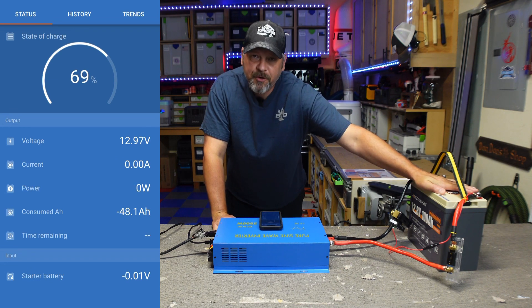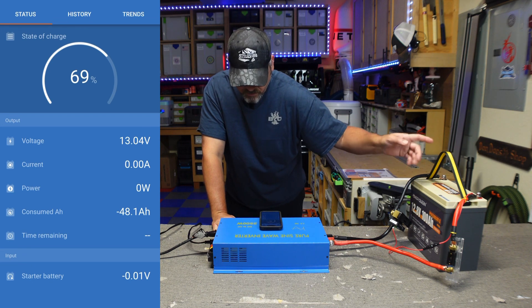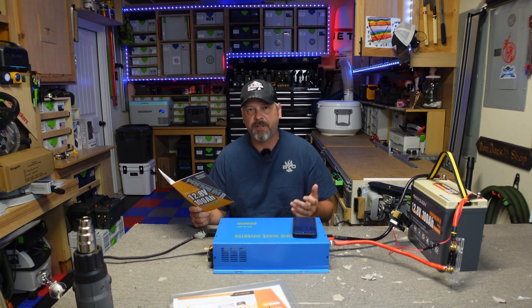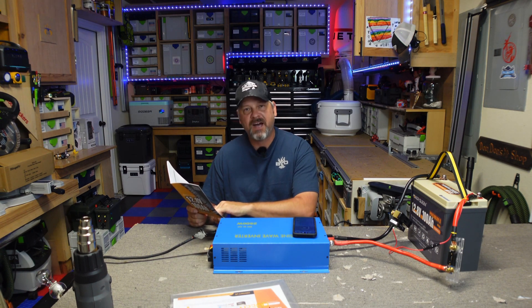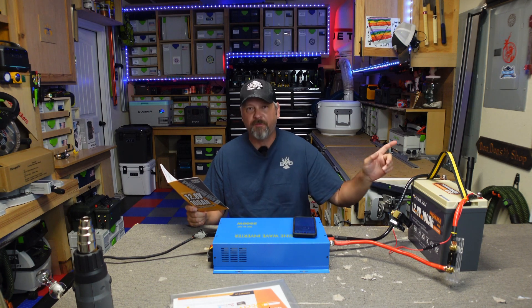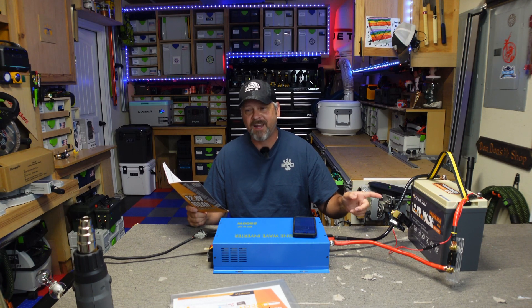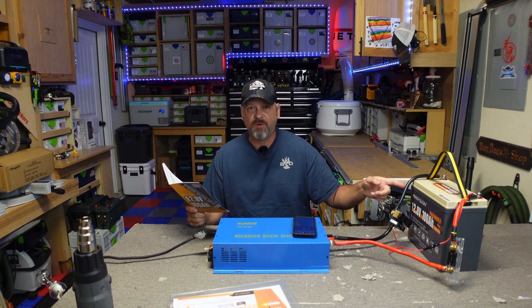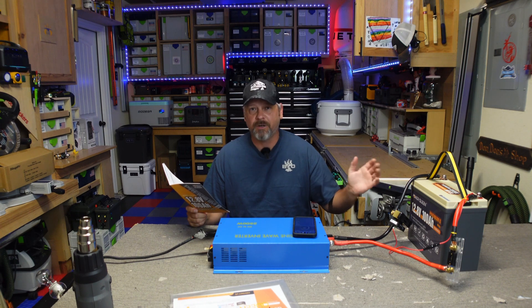It shut off. I was able to pull almost 230 amps out of this battery, but I'm not sure if it was the inverter or the battery that tripped. After investigating, I pulled almost 233 amps off that setup. According to Power Queen this battery has a max discharge of 250 amps for about five seconds — I didn't quite reach 250 amps — so I believe the inverter got overpowered and shut itself down first. Based on that test, this battery is capable of getting close to 250 amps for a brief period, since I was running 220+ amps pretty solidly before the inverter cut off.